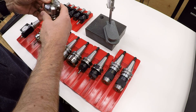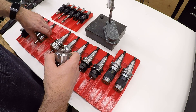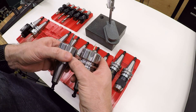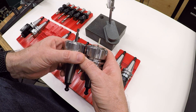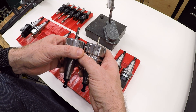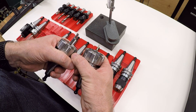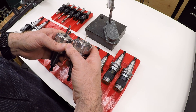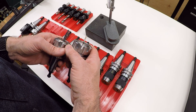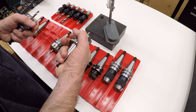I've got a quarter-inch end mill, a spotting drill, an eighth-inch end mill, and one of the things you'll note is that these different tools stick out a different length from the face of the tool holder. So if I'm going to run a program and swap from one tool to another, then the controller — in this case Mach 3 — has to know the relative lengths of the tools so it can compensate, so that the tools will cut at the same height and I can make a part.